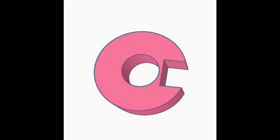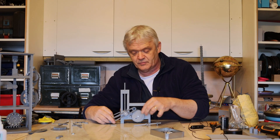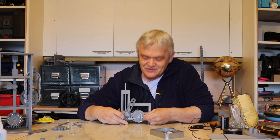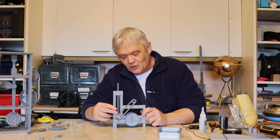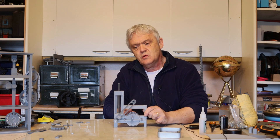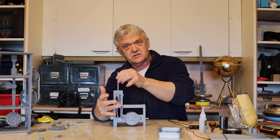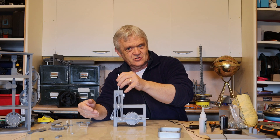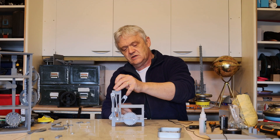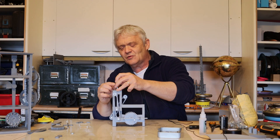Once it's in, there's a ring with a notch — that's where the pivot pin connects to the lever arm down at the bottom. It glues onto the end; once it's in its slide guide we put a pin in it, connect it to that pin, and put a cap on it. Now if I turn that gear you can see those levers move a very long distance — that distance changes as I pull the slide up because the pivot point is changing. Work in equals work out: as we change distance we change force, and we've essentially done our CVT.